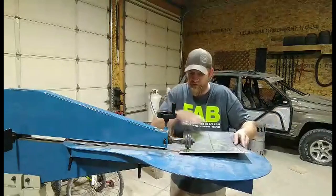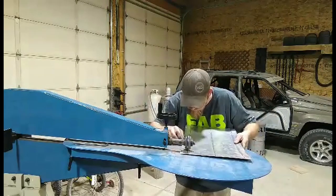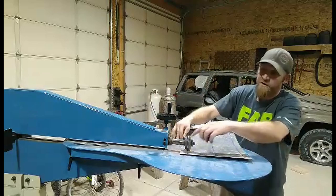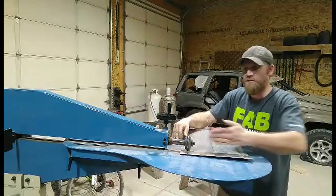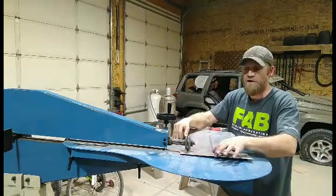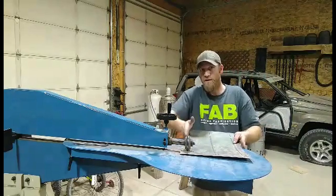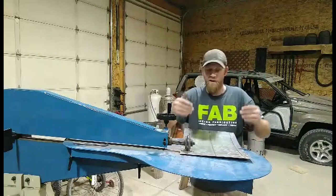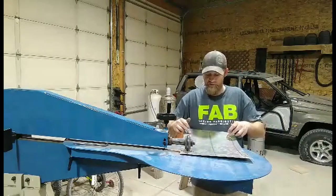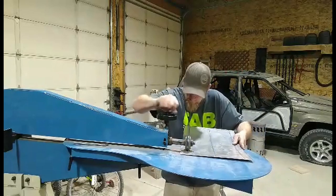This way, just so I got the majority of the panel out here. Really what I'm trying to do is line up the center of my shaft on my bead roller with the mark that I made. It's 2.5 inches down, and then the center of the radius on my line going this way. That way I've got the same start points on each one of my bead rolls, and the same stop point on each one of them at this end too. And I'm right down the center.